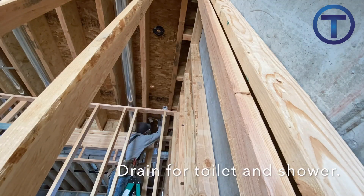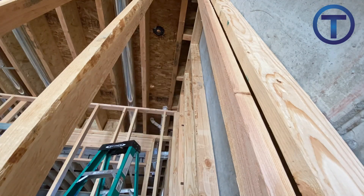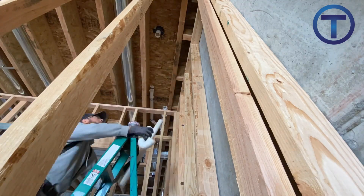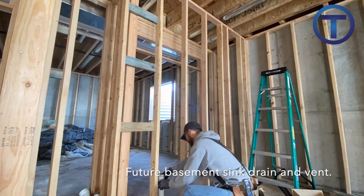At this point I'm about at the end of the line — this is underneath a master bathroom. I'm hooking up the toilet, running a vent, there's a wire that's going to go up through the middle between the toilet and the shower, and then I've got the shower right there. I'm hooking up the P-trap for the shower.